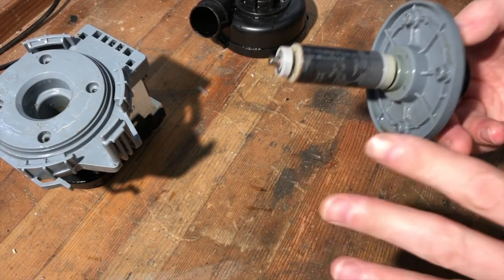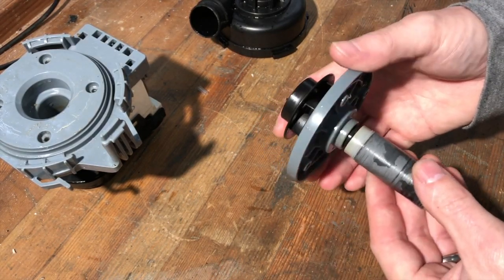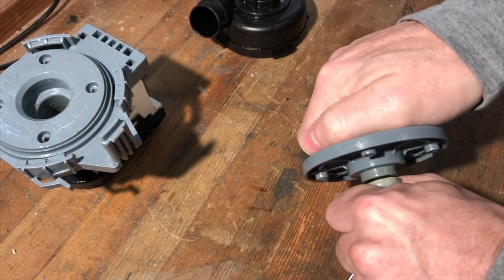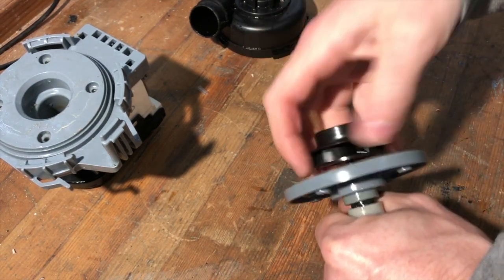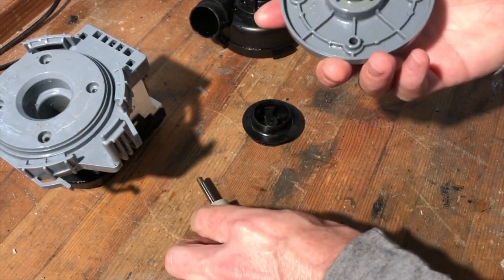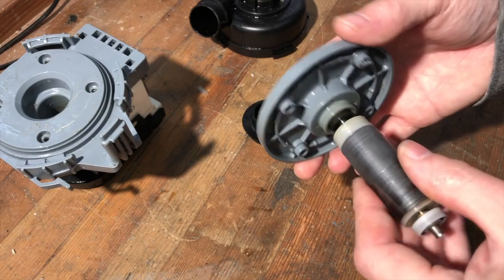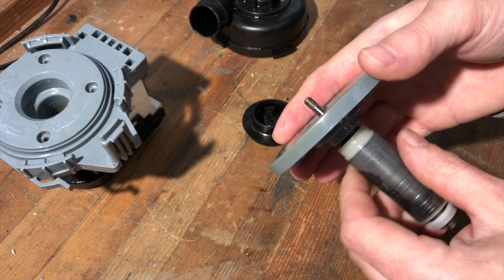There are two possibilities of what happened here. One of them is that it's this bearing. I didn't replace it last time because I didn't know how to get it apart. Then a helpful commenter — now pinned in the original video — told me that this just unscrews. Yep, and it's even right-hand thread. So here's the top bearing; I did not mess with it last time, but there is a lot of slop. I'm going to see if I can't improve that. I'm not positive that's the problem, but it doesn't look good.